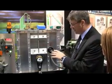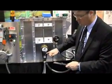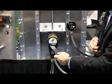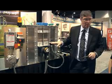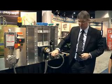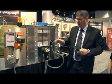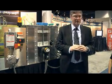We can verify this and test this by placing a putty knife between the M800 whirligig and the whirligig cover. When we do that, we should get an immediate shutdown. The shaft has stopped, so we know that the sensor is installed correctly — it's wired correctly to the machinery shutdown and everything has stopped. This has been the normal way of testing this switch for many years.